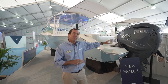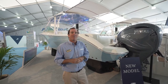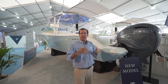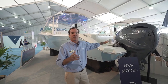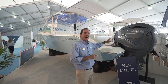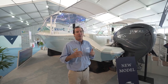That gives you great fuel efficiency and a lot of speed. For instance, with these 425s, cruising at 3,500 RPMs you're running 32 miles per hour and burning about a mile and a half per gallon. That's a 275-gallon fuel cell, so the range is enormous. The boat jumps up on plane super fast — about 5.7 seconds to get on plane — and the top end is about 60 miles per hour. It's a great performing boat, super fun and really exhilarating to drive.